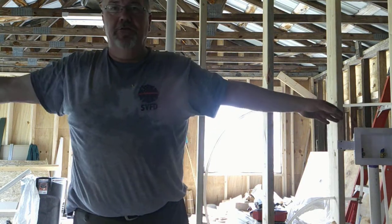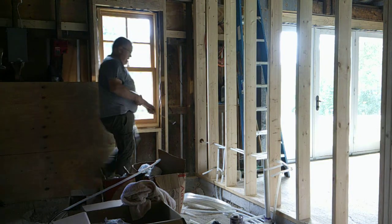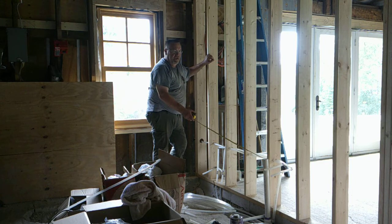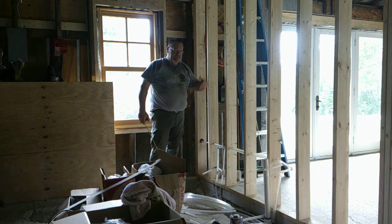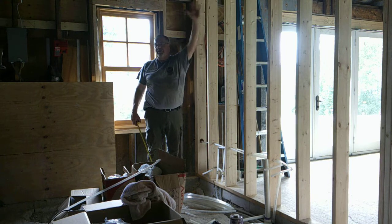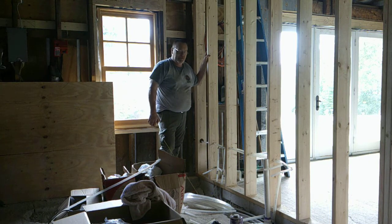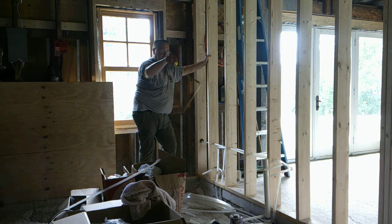I've got two hose bibs, one on each side of the building — those are just a standard 10-inch frost-proof hose bib. We're coming back off of our 2-inch, which comes down through here and picks up the lab sink right here. This is where our laboratory sink will be. These are our water lines coming in — we'll put a shutoff valve on those, simply because there's only a shutoff in the house. The water system here is a gravity feed coming down the hill from a tank that's probably 75 feet higher than we are. I don't know what the pressure will be at this point, but I'm assuming it's going to be somewhere around 40 to 50 pounds. We're going to come in there, shut off here, get a back feed to there, go right to the water heater, and then come back out this way.